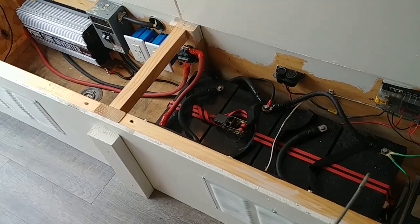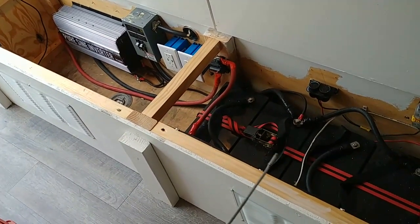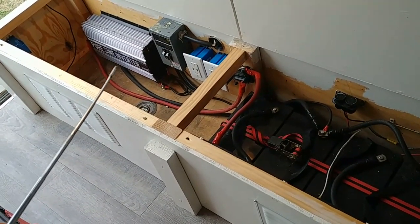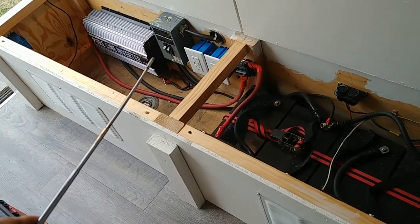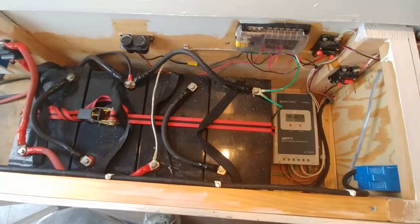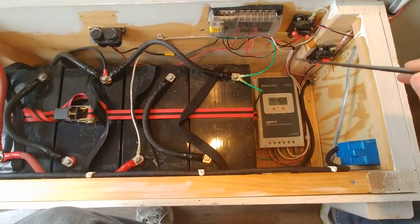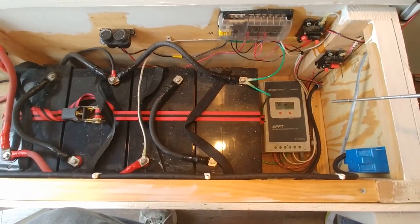The third system to tie in is the battery bank into the pure sine wave inverter. This battery bank is DC electricity and it will tie into the sine wave inverter that will convert it to 110 volt electricity. So now you have this source of 110 volt and these two other sources of 110 volt as well. For those who have seen my past videos, you would have noticed that all of this 12 volt DC wiring here was red, and all those red wires were very confusing.